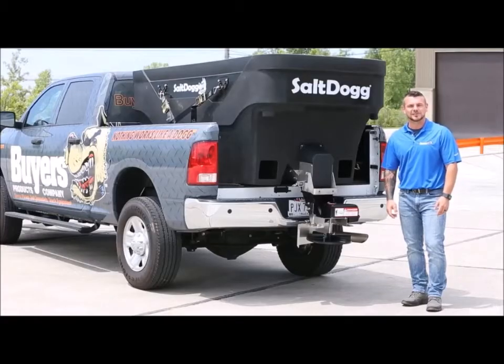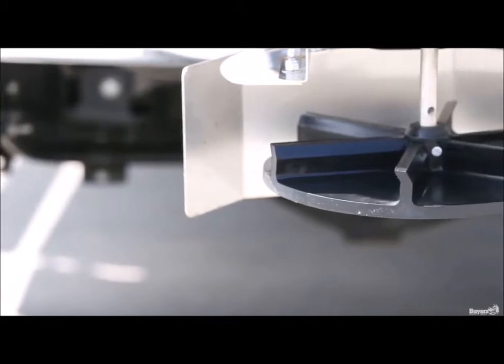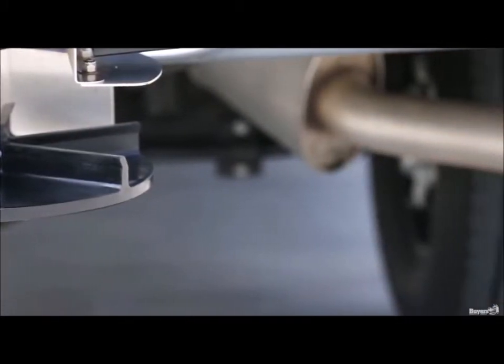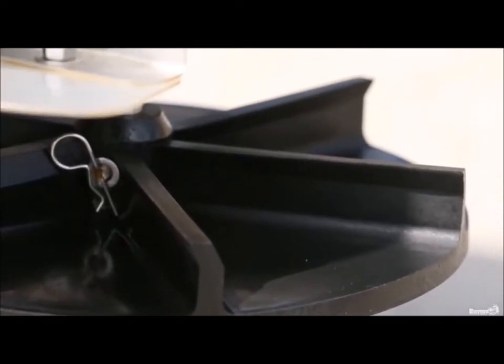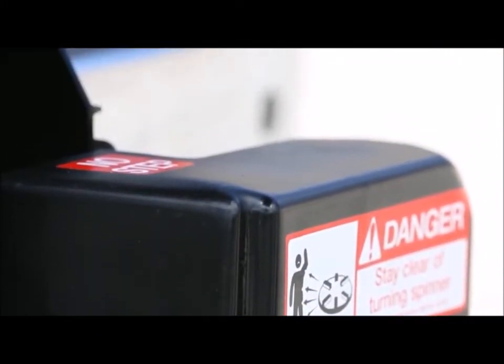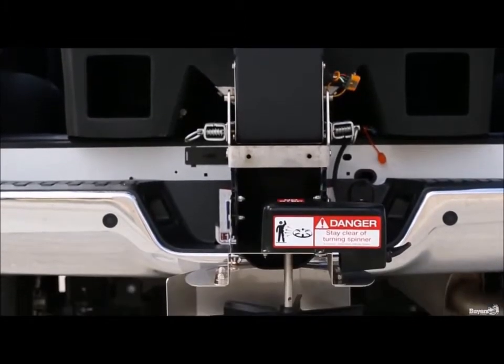When you're out fighting a snowstorm, you need your spreader loaded with the right type of material. But different materials have different weights, and trying to use a one-size-fits-all approach to your spreader settings will lead to suboptimal coverage and wasted resources. The heavier the material you're using, the closer to the center of the spinner you want it to land. Your spreader needs more windup to properly throw heavier materials like bulk sand or salt sand mix. Using the wrong setting for your given material can cause it to be flung too far or not far enough, affecting both the quality of your work and your bottom line.